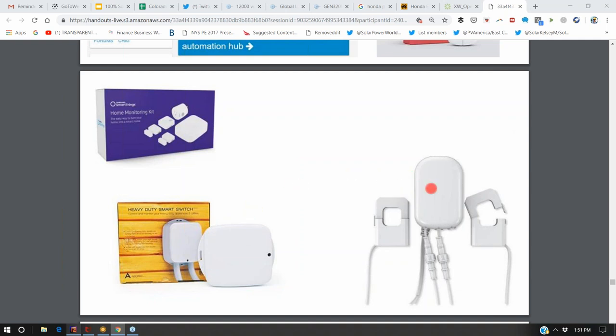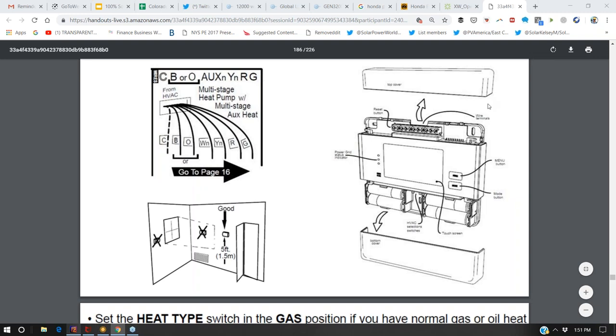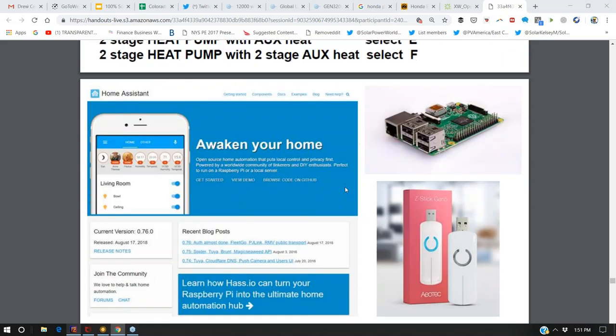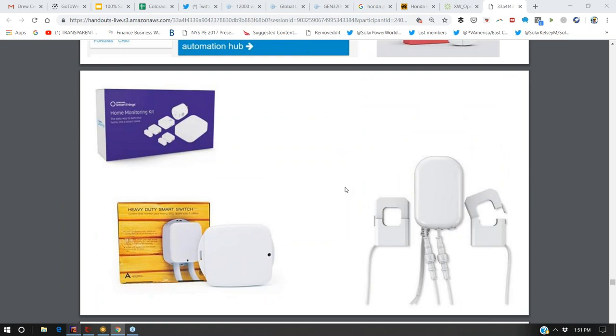Now, these devices here cost about 90 bucks each, but then when you buy them through the rebranded, like Samsung or whatever, they end up being like 300 bucks each. The Nest thermostat is expensive. I prefer to get a brand called Radio Thermostat, which makes a Z-Wave thermostat, and it's like 40 bucks instead of 300. The fire alarms that we're putting inside this house are Z-Wave fire alarms that are also carbon monoxide detectors. And often a lot of Z-Wave devices will also relay temperature information, to the point where you don't really need a thermostat anymore, except right next to your air handler unit to trigger that.